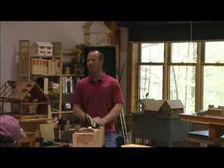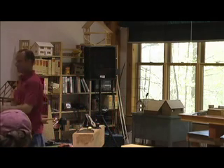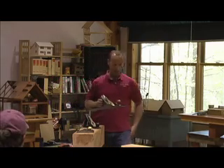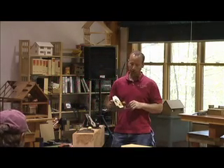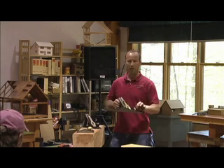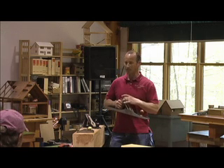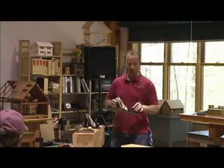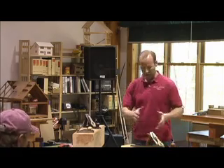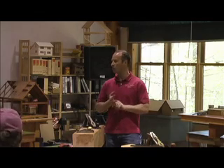Someone has brought in a number seven and eight. This is a Lie-Nielsen plane — they make extremely well-tooled, very well-designed planes. The balance on them is excellent, the weight of the body is fantastic. They use a nice thick A2 cryogenically-treated tool steel. It takes a very keen edge and stays sharp for a long time. It comes with a price tag. One of the big advantages to the Lie-Nielsen is that they are generally ready to use right out of the box, whereas many other bench planes don't come particularly sharp or particularly true.